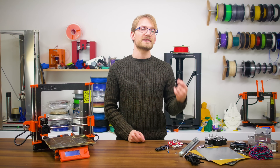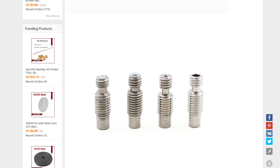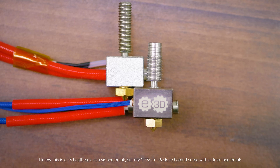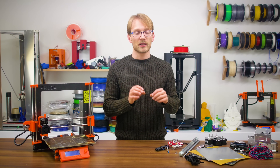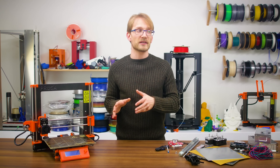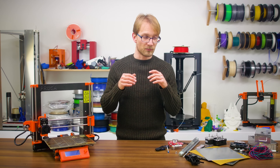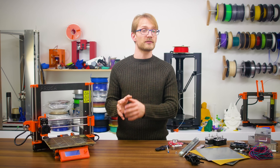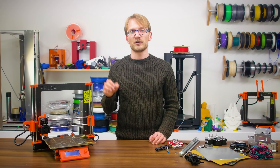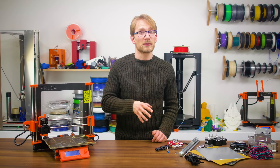There are two different versions of the V6 — one has been modified with a Teflon liner in the heatbreak. The original V6 doesn't need a liner since the surface inside the heatbreak has a much better finish and won't stick to your filament, and the genuine heatbreaks are also machined thinner, which is harder to do but essential to keeping heat from creeping up to the heatsink. On knockoff hotends, the machining finish is often too poor to work reliably, so if you can live with a maximum reasonable temperature of around 250 degrees Celsius, your best bet is going to be a Teflon-lined version, which you can usually identify by the listing being described as an improved type. I personally went with the true all-metal version because I wanted to see how well it works, and I have backup components in case it doesn't.